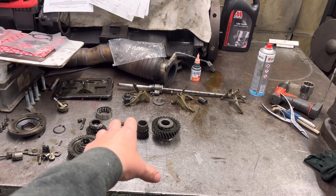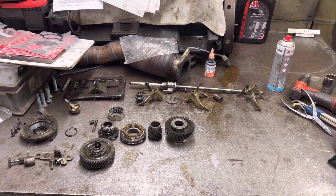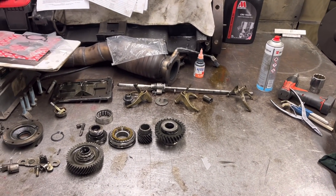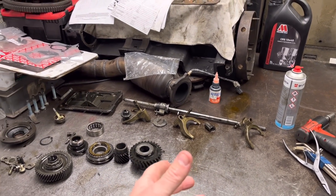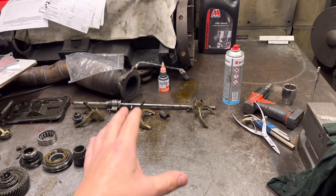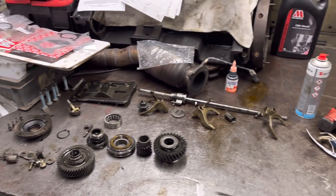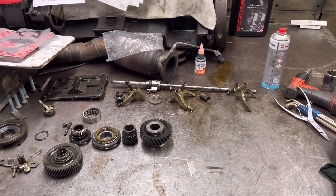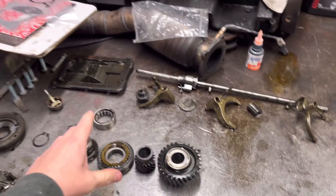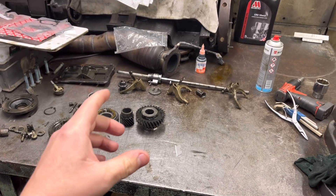This one is actually in a kit car, but it is a Type 9 gearbox, and to be honest it's the first one of this exact type I've had apart. The reason it came apart is the customer has bought the car, he's having the engine done, but he's unsure on the gearbox. Apparently when he drained it there wasn't much oil that came out at all. So it's really just a strip-down inspection — replace any parts, maybe synchro rings and bearings. I've got all the gears off one end and the casing is outside with the other gears still in it for cleaning.